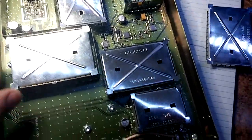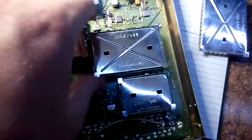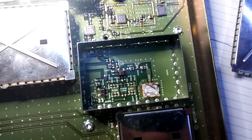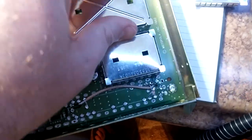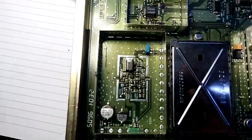This is the receiver. There's an image filter in here somewhere. The image filter cuts off the upper end of the receiver, but this is actually a wideband receiver — that's the image filter right there. It causes a loss of sensitivity as you get above 914 MHz or so. But this is actually more wideband than a standard 900 receiver would normally be.